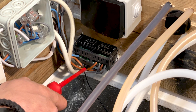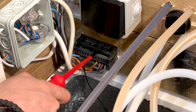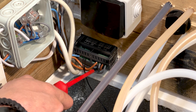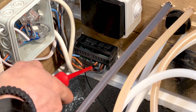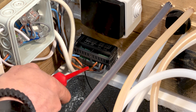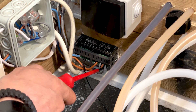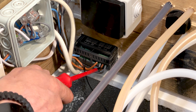This wire is actually hot — this is my L1. When it gets too cold, the heating turns on and connects this, so this is the power supply for my heater. There are no neutral wires in the output terminals — they are all hot, all L1s.